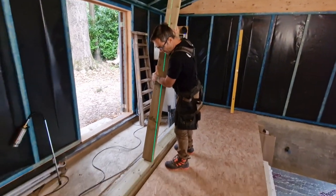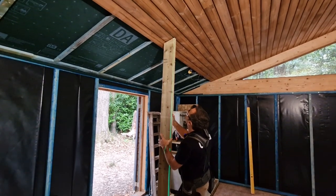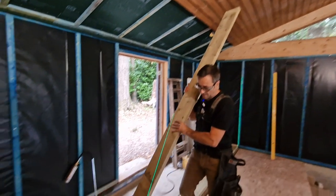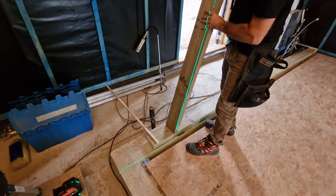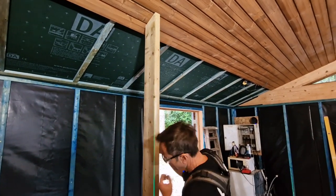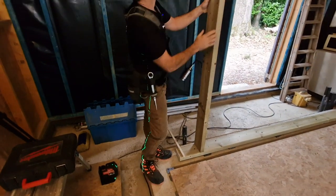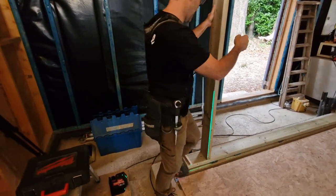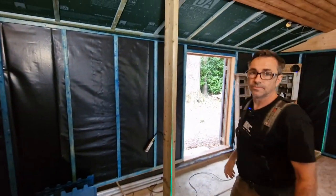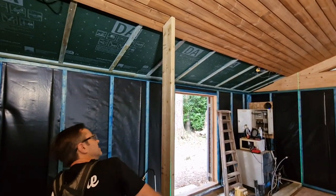And we'll check it here. It's nice and plumb. I mean, we're looking pretty good. On the whole, it's virtually the same all the way along. Let's try it down here. So that's on just the shim size. So we're a bit tighter at this point. Now, this was the high side of the shell. So what we need to do is actually make our adjustment to suit this end, because you can see it's a bit of a, I mean, it does go. I think we're wise to actually stick with this.